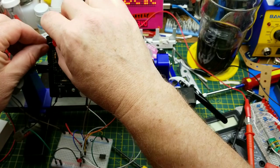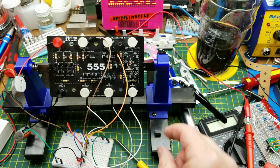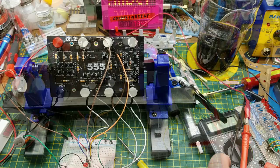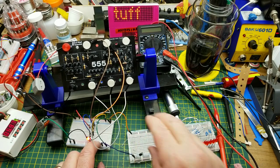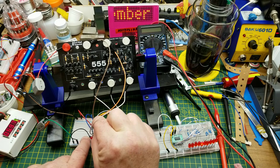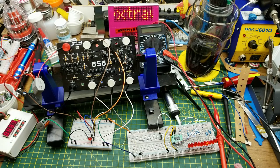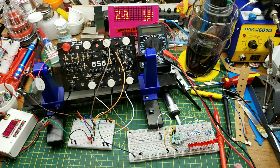I will solder it back in the correct way and try this again. Cross your fingers. I've tested my circuit on the circuit board with this 555 here, and then I've just plugged these wires in the same place as the pins - and finally we have lift off! That's what I was looking for. So now it should just be a simple matter of connecting up power and ground for this 4017 circuit, taking the output and putting it to the input of this circuit. And there it works. One stupid mistake, not paying attention, and I messed myself up.